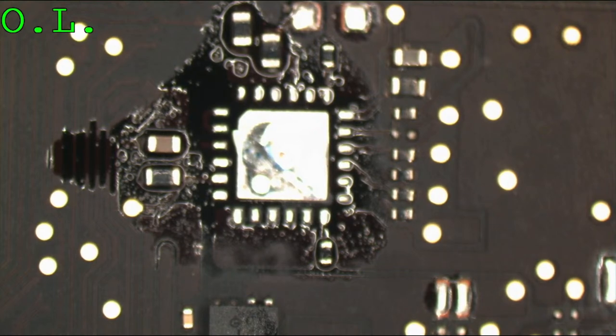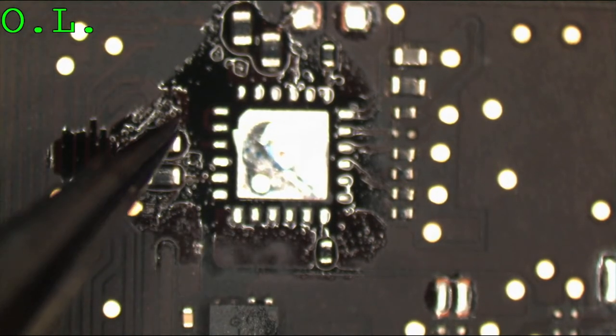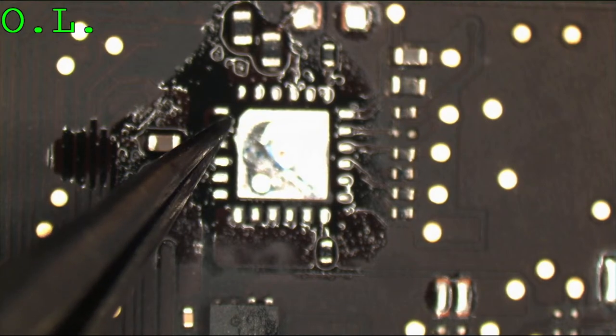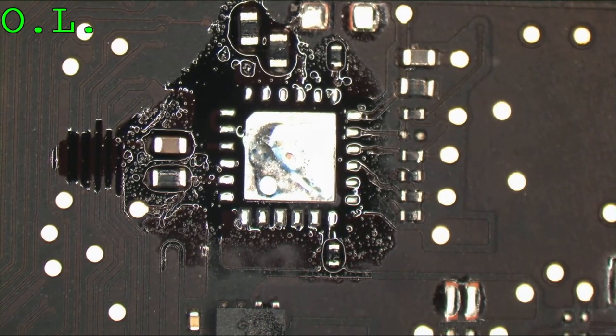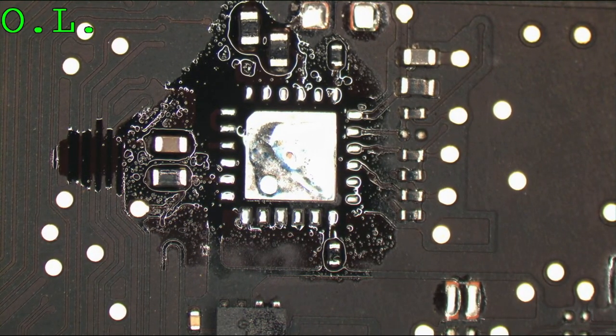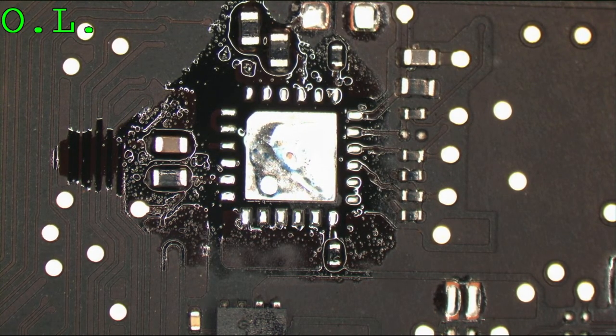Oh, look at that. This is interesting. You don't see this very often. This cutoff corner in the ground pad there, that's actually an indication for pin 1. Some engineer at Apple probably lost their job because they left that in there, because I don't think the computer reads that. The computer knows what the orientation is. They don't need to see a cutout. That's for people reworking, that you would have a cutout for pin 1.